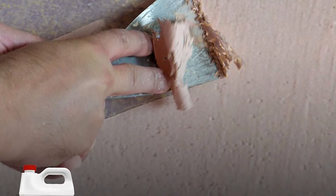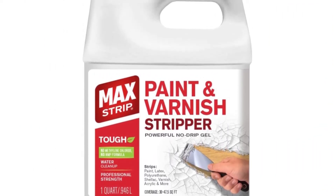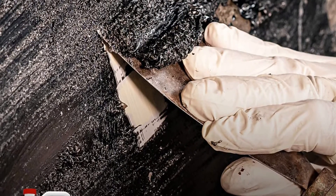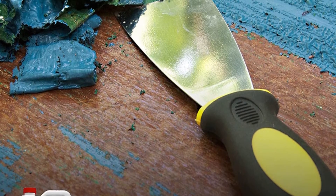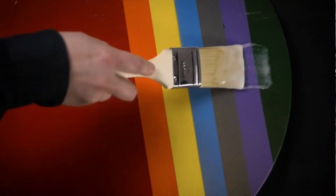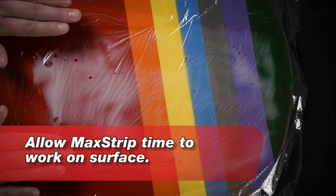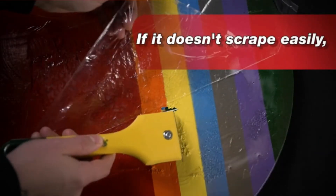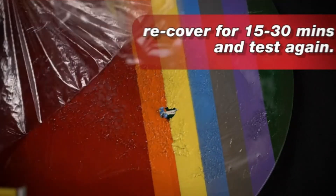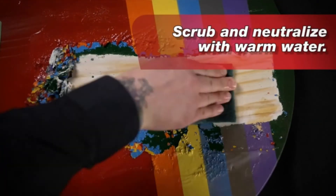Use it to safely remove paint and varnish from metal, glass, laminate, fiberglass, wooden surfaces, porcelain, plastic, and more. It is advisable to test a small area first. Please keep in mind that this product is not intended to remove factory-finished or baked-on paints. It removes wood stains effortlessly — follow the instructions and it will be up and running in minutes. It cleans up easily with water and white vinegar. Wear gloves as it gets messy. Try to keep it as wet as possible and do not use it under direct sunlight.